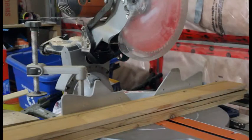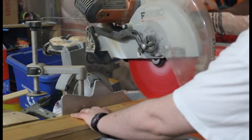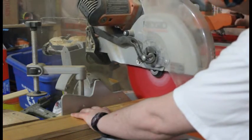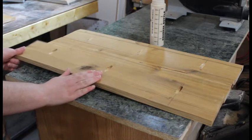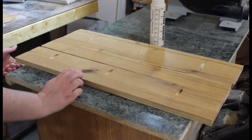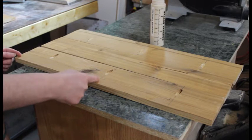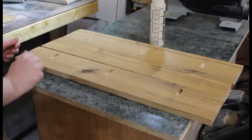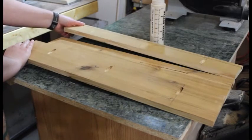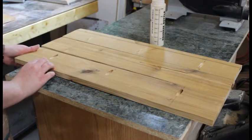You want to cut them down to your final length, which is 24 inches. I laid out the marks before I went ahead and drilled my holes with a pocket joinery jig by Kreg — four inches in and then 12 inches in. I only did it on two out of the three boards, just the two on the ends, so you should have six holes in total.